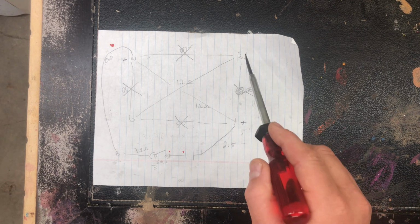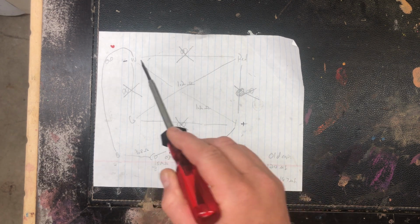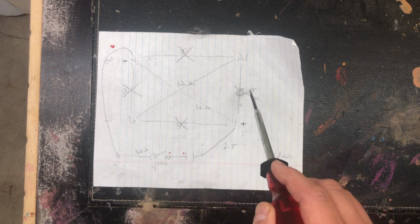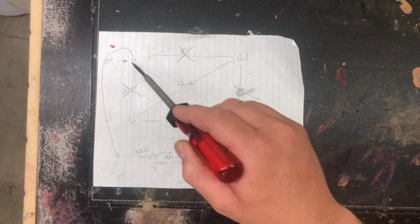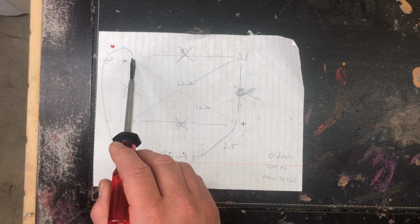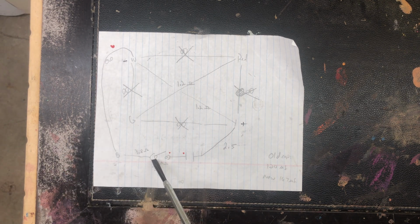So I started there. So you'll see here, red to gray was 1.2 ohms, white to yellow was 1.2, and then these 4 paths were all, I marked infinity, that's no connection, infinite resistance. So I know these are my 2 coils. So that kind of makes sense. One of the black wires went straight to the white because it measures 0 ohms. So that's a dead short. There's no coil there. Here's the switch.